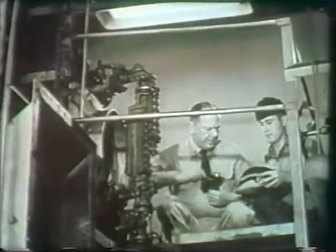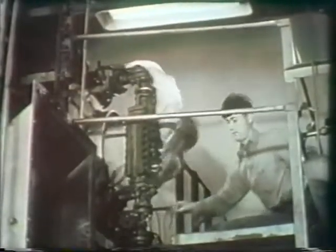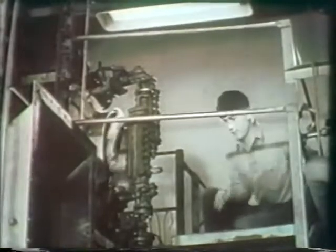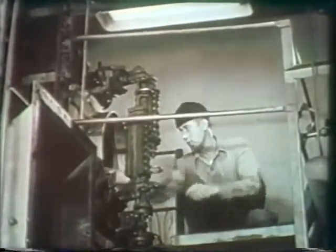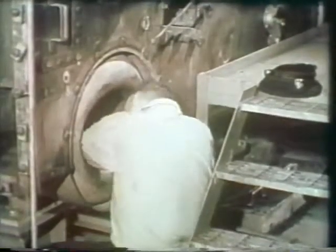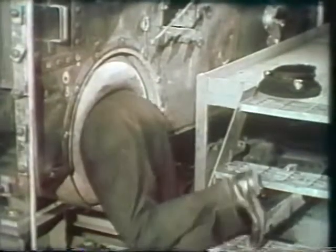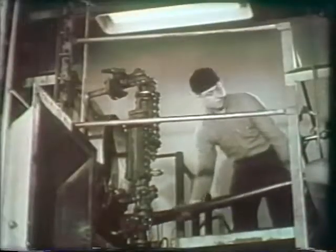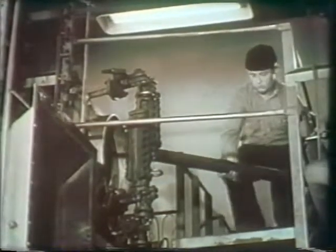Whenever the water sides of a boiler have been opened, it must be inspected, closed, and hydrostatically tested before being placed back in service. Inspect all drums and headers for loose gear. Also, be sure they are clear of personnel. All the internal steam drum fittings must be reinstalled.